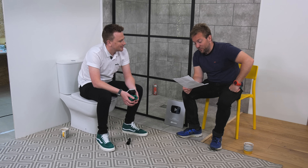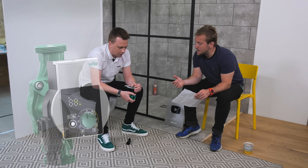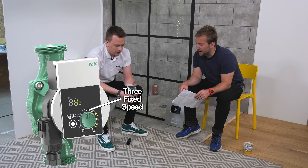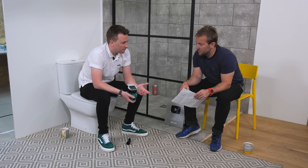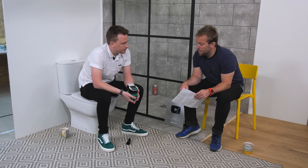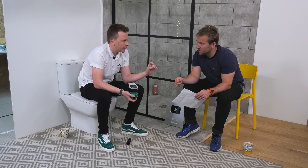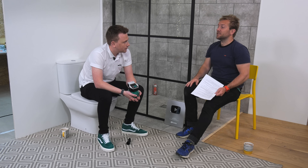Terry Diaf just says 'tell us about the pump.' Basically the pump has got three operating modes. You've got a modulating mode for radiators on one side, a modulating mode for underfloor heating on the other, and then what they also put back in was the old three speed fixed speed settings. Basically if you had a really old dirty system and you got called out on a Saturday night to change the pump over and put it on modulating mode, it probably wouldn't run because it sees all the dirt gathered in the corners and thinks it's a TRV so it just keeps backing up. So you can just stick it on fixed speed and get away with it. The underfloor side is for a system that's got underfloor heating — the narrow pipe gauge and long pipe runs mean you don't want it on the fully modulating side because it would just keep backing off as it sees the resistance.